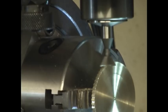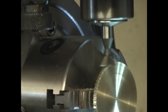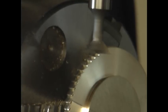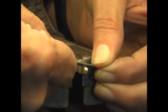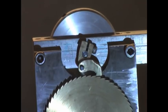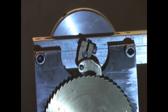My goal is to have the pendulum cycle once each second. My pendulum shaft runs on tiny sealed ball bearings. I'll build a crank on one end with a pawl on it, much like the inside of a ratchet, so it can claw the movement ahead 6 degrees for each stroke of the pendulum.